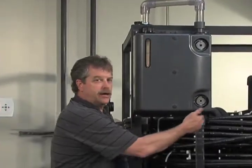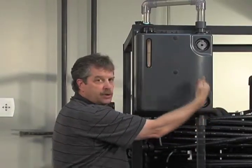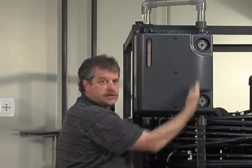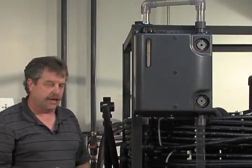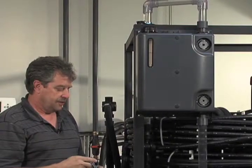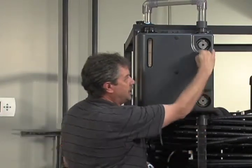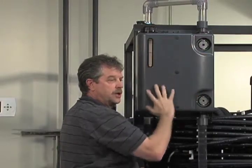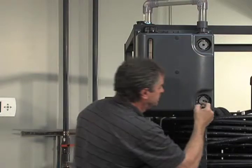So we've actually had our valves in a position where the off portion of the valve was pointing toward the tank. So we're not flowing through the tank. We're bypassing the tank for, again, flushing purposes, to make sure we get the air out of our system with the proper flush cart. Now we're going to rotate these valves so the off position is here and here, so that the flow is going through the reservoir and back down through the valve into the heat pump itself.